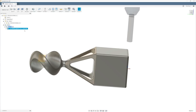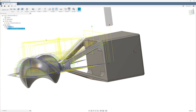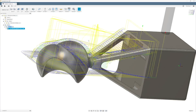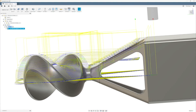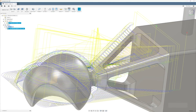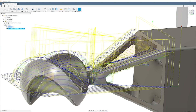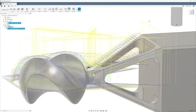It's calculating — 56 percent. Check out that toolpath! No matter how much I program, I love seeing toolpaths come together. You can see at the bottom it's beating in and coming back, then lifting up and moving over — it looks so good. See this pattern right here — it doesn't go all the way through because I turned off cavity machining. It leaves material there, so you'll still have solid material through the center. We finish the outside first, keeping it more rigid, then come back and clean it up.